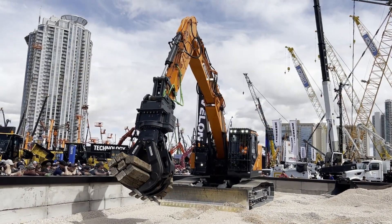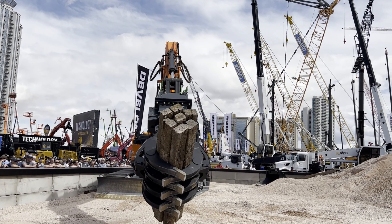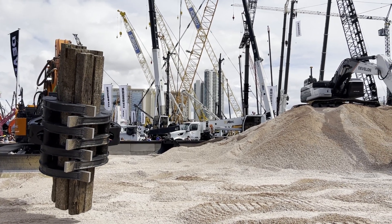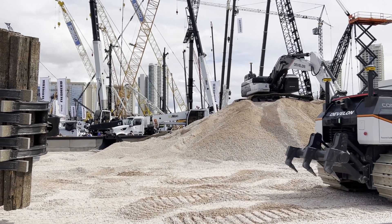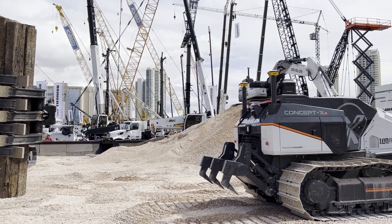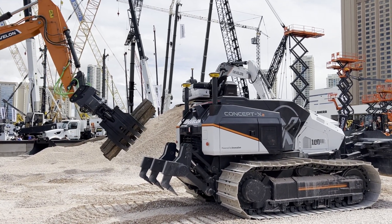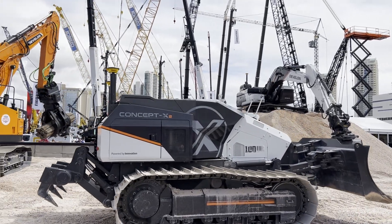The 350 LCR is coming into the picture in the background, and operator Joel Escalante is going to plant some railroad ties to demonstrate what we call the advanced e-stop safety feature on the dozer. The rear of the dozer has a wide-angle sensor that automatically detects an obstacle behind the machine while in autonomous mode. Whenever it senses an object — whether railroad ties, a person, or anything else — it will automatically stop.